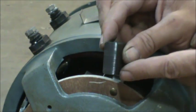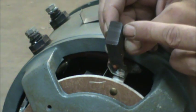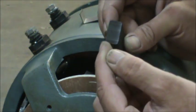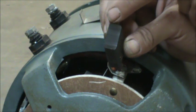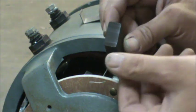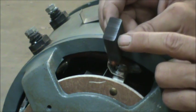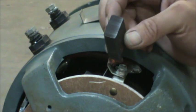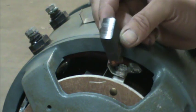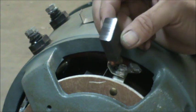The reason why I wanted to run the motor was to make sure that this brush would make as close to a hundred percent contact as possible all the way across the width. I can see only slight spots on this side over here where it's not quite seated in yet. The more contact you have with your brush, the less chance you have of arcing when the motor comes under load. We have a really nice commutator — you can tell it's been cleaned and probably machined — and arcing would pit the commutator, so that's what I wanted to avoid.